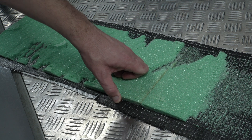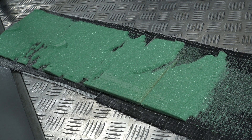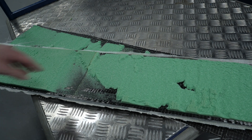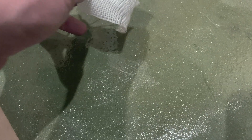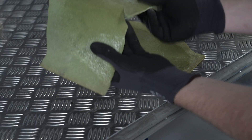I noticed that the foam had cracks in it width-ways. This means that as the beam was bending, the foam was failing in the orientation you'd expect any brittle, low-to-medium-strength material to. Splits in a core actually don't matter so long as they stay bonded and don't crush under compression — you commonly butt-joint separate sheets of core materials together anyway. I also did a brief test on a thin sheet of PVC core foam to see the behaviour of curing resin: I wanted to find out the window of time between the resin being too thin and when it's only slightly tacky and nearly cured. It turns out you have about half an hour at room temperature for a fast-cure resin.